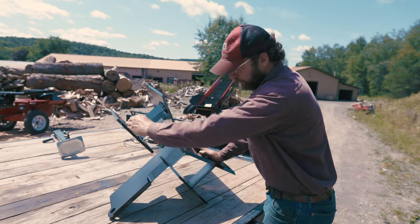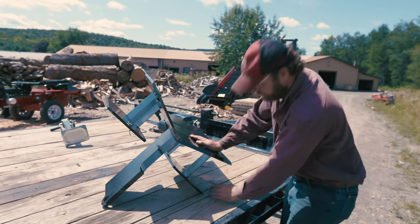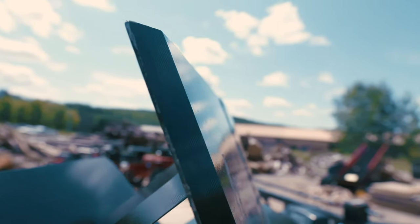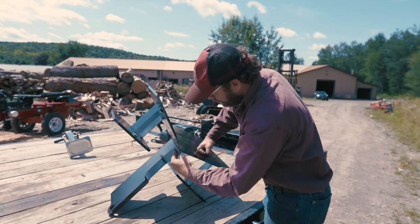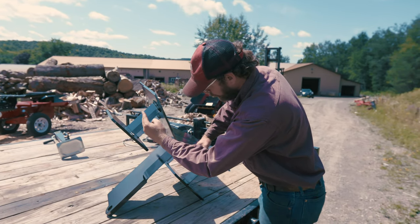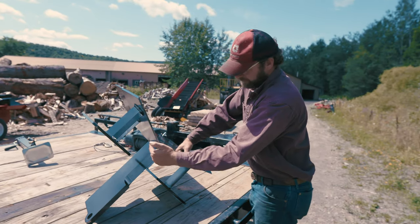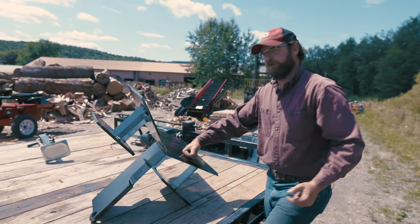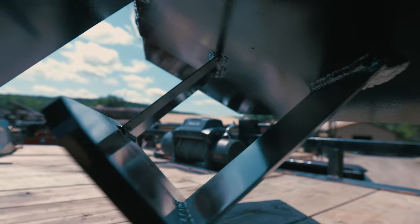So you're going to get 1, 2, 3, 4, 5, 6 pieces of wood for every 4.5 inch chunk that you get out. We've got 9 inches between this center and that center, and then 4.5 inches between this center and that center here. And then between this point and this point, we also have 4.5 inches. So you're gonna get 4 pieces that are exactly 4.5 inches.